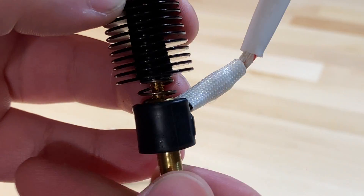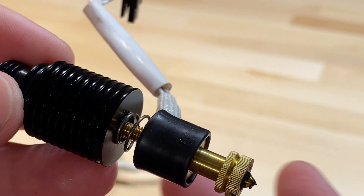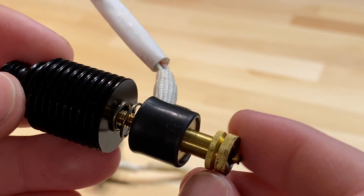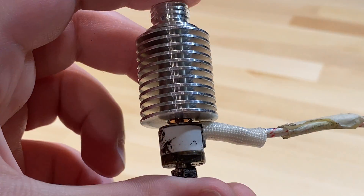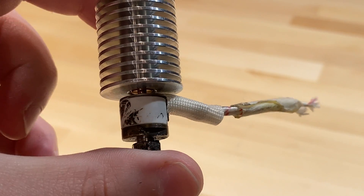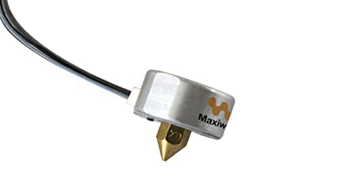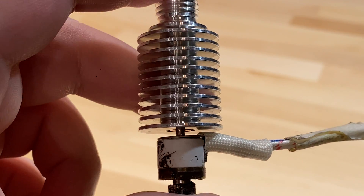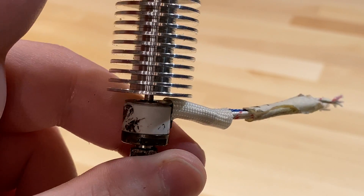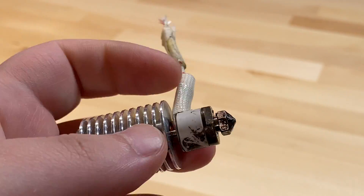The main negative of this design is that the nozzle is patented, so you can't buy a cheaper or potentially better third-party nozzle. That's why it would be nice to see the round 1 style released — compatible with the existing V6 ecosystem with a different jacket-style heater. The PTC thing is a nice addition and it's smaller than the Maxi Watt, so it would be a good product.